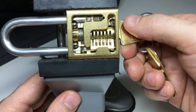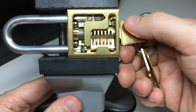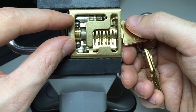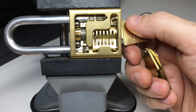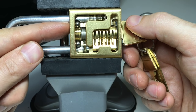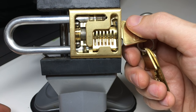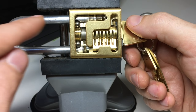So that's one thing. How does the actual mechanism work, where you're unlocking the lock? Well, in a standard padlock, you have an actuator directly acting on locking pawls which are retracted from notches in the shackle. The downside to that kind of mechanism is it is susceptible to a shimming technique, where you push a piece of metal down the side of the shackle, forcing the locking pawls back against the spring-loaded mechanism inside. You cannot do that in these locks.